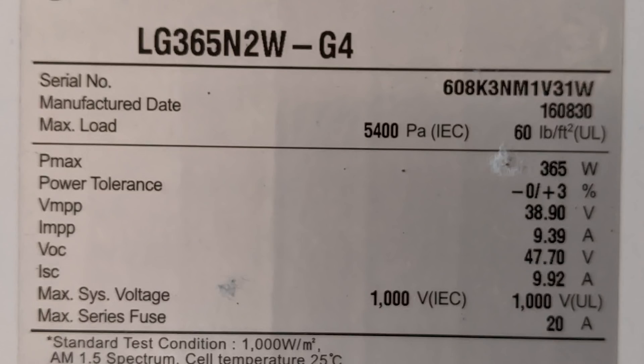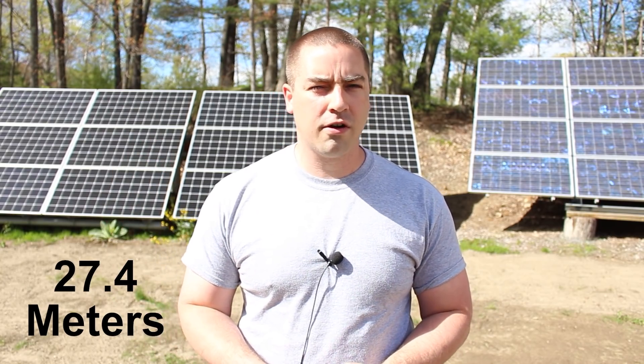These panels at max power are about 9.3 amps, so I could have used 14 gauge wire. But I chose 12 gauge because it's about 90 linear feet of wire to get into the garage, and that length means there will be voltage drop which wastes energy. Upping the gauge also helps because when you pack several wires into a conduit past a certain number of conductors you have to derate the wire. So I'm running 12 gauge THHN wire inside a conduit.